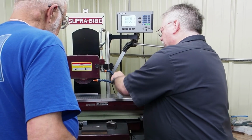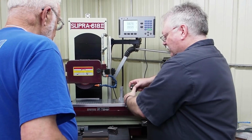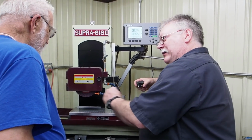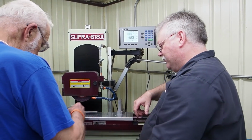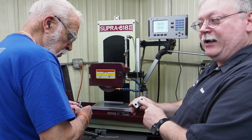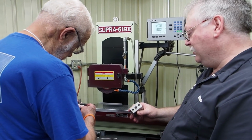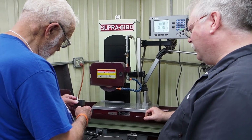And now I can turn this at whatever angle I want. I'll have that round holder in there so I can, on the fly, rotate whatever angle. Now I'm not going to have to get in there with my hand, and I'm going to have a lot more precision. Right. And it's going to be a lot safer. What I'll use for truing the bottom of the wheel is these cluster diamonds. I love them. In my opinion, I get a better grind, better finish. They last forever.